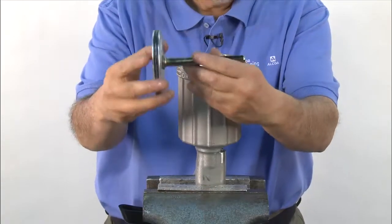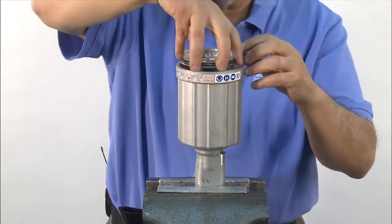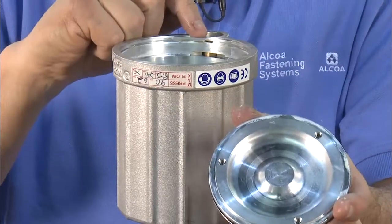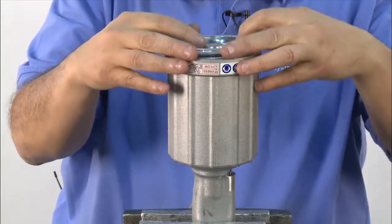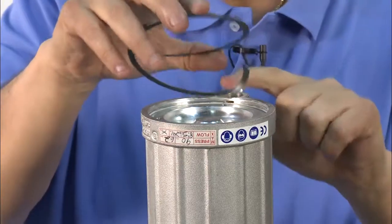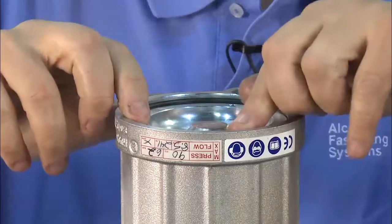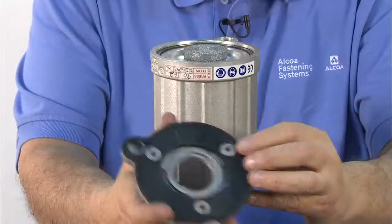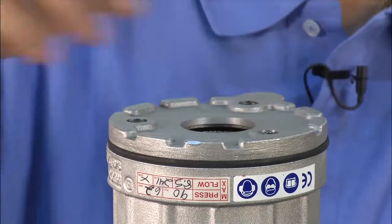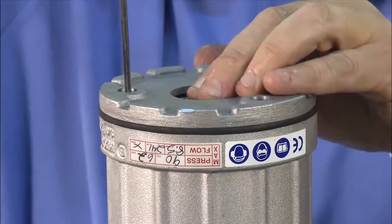At this point, bring the air piston rod in. Lightly lubricate the piston rod and seals, then push the rod in. Install the back cap, lining up one of the holes with the indicated spot. Use the brass hammer to make sure it is bottomed out. Take the spiral lock ring and walk it into the groove — be extra careful to ensure it's properly installed. Now insert the muffler and back cap with the rubber gasket, and insert the screws using an Allen wrench. Manipulate the muffler to ensure proper alignment in the back cap.